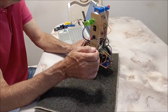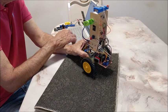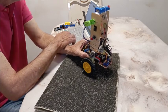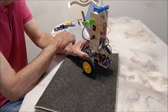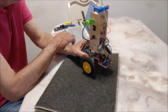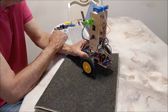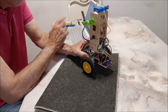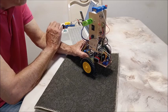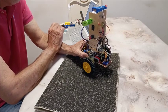This is probably the shortest, simplest, and most effective code to self-balance a two-wheel robot — in my opinion, and I'm happy to be proved wrong. Most of the code isn't mine, so I can't take credit for it. This robot will balance and stay in place on a smooth surface like a stone floor. Most robots with these motors will not do that — they drift and fall over, which I believe is due to bad timing loops. The MPU-6050 complementary filter code is effective. In the program I use a complementary filter rather than a Kalman filter — it's very simple, very fast.